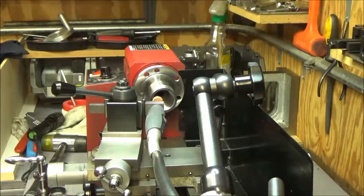I had to drill it and tap it for the pencil grinder, and also mill a little bit off the top and bottom of the bar so it centers up in the tool post holder. Anyway, I'm going to run this through one shot and take off 2/10 or 3/10. It seems to creep just a little bit, but it's hard to tell. The tenth indicator is really sensitive, but it does work really well. So that part's no problem.